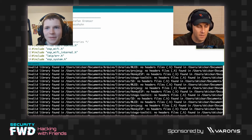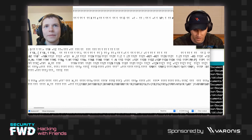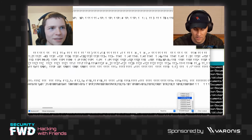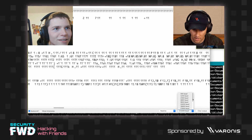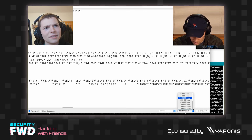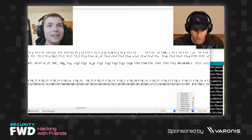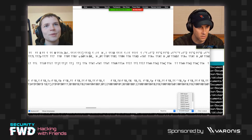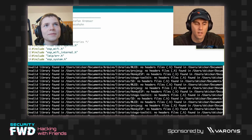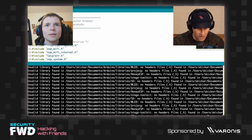But anyway, all right. So I'm going to press Command-Shift-M, and let's see what the heck happens. 115200 baud gets us a bunch of nonsense. What baud rate should I be using? The 900 whatever it is. It's not available in there. Oh, fun. Okay, so we have a baud rate that we can't see in the serial monitor. But you won't be able to see much anyway. It's transferring raw data, so it will be similar to what you're seeing now. Okay, but if I see this, and it's not just saying that it's crashed, then at least we've got something going on. Okay, cool. All right, so this tentatively worked.